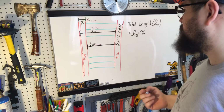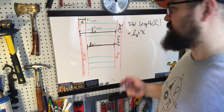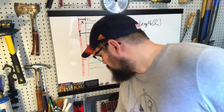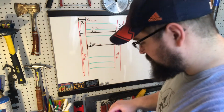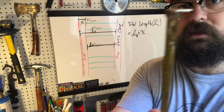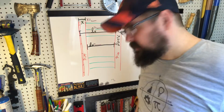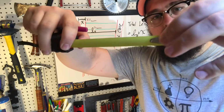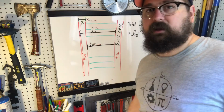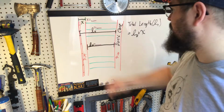Alright, so now we can figure all these out, but I want to do it this way just as something different, and also because I trust it a little bit more. At the end of a tape measure, you have this area in here, and I always have questions about its accuracy sometimes because it can move. So I generally pull it all the way so it's taut, and then I take the measurements here because it doesn't matter. If I pull it taut each time, it's going to be the same because I'm pulling it from this side.